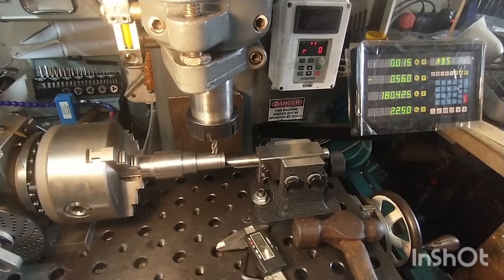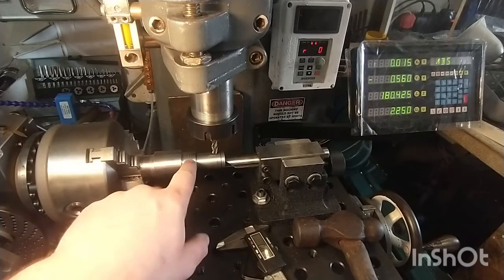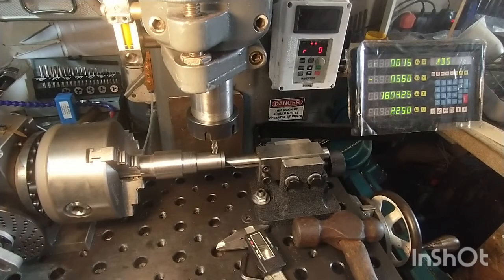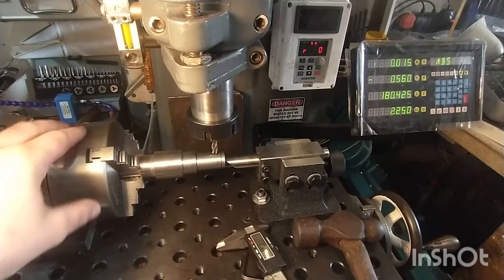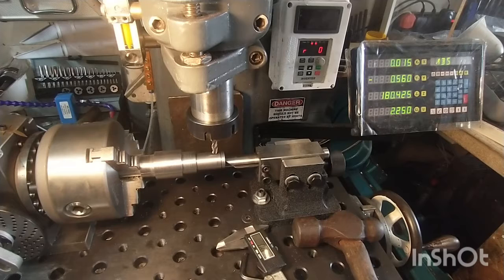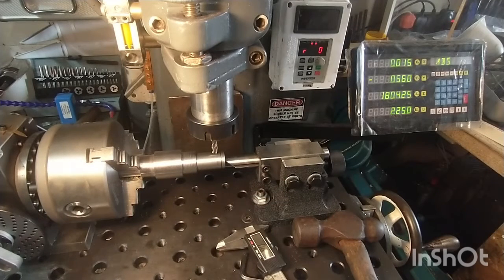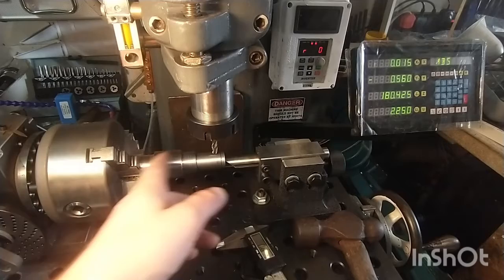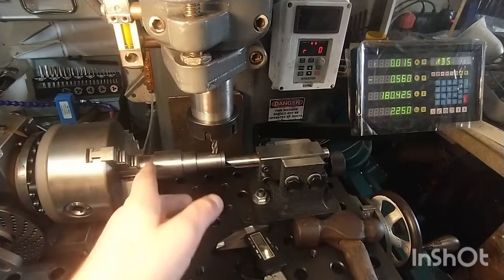Hi there guys, so we're over on the Alfred Herbert vertical milling machine. Today I'm going to be working on milling the two keyways, 8mm keyways, into this Wacker plate drive shaft or vibration shaft. So these keyways are 8mm wide by 20mm long. I've got the shaft set up in my rotary dividing head, and I've got a supporting tailstock on the far side there just to help with rigidity of the setup. And I'm just about to start my first cuts on this side, and then I'll be swapping the part around and taking cuts on the next side as well.